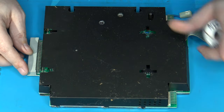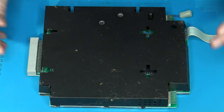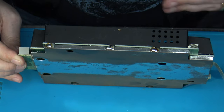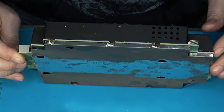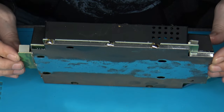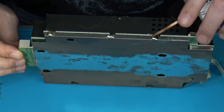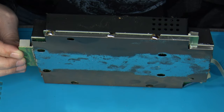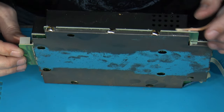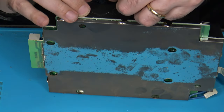One thing I did forget to mention is that you will probably need some desoldering braid or a good desoldering pump, since again, in order to get into the Model 1 Intellivision, it does require you to remove the RF shielding, both halves preferably, just to make it easier to get to everything. And because of the massive amounts of soldering that has been used on all of these, it can be kind of tricky. So initially, I'm just going to use some desolder braid to remove some of the bulk of this, and then come back with my iron and perhaps like a small screwdriver to lift the tabs up one by one off of each other so that I can get the whole assembly removed.